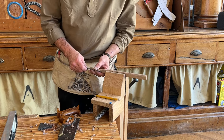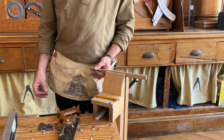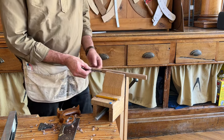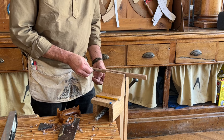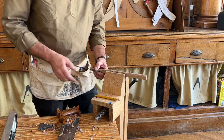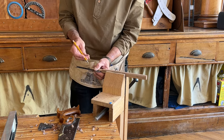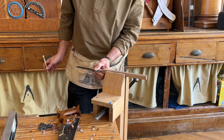This is the full length tenon and it is about two and seven eighths inches long — that's too long. We want two and a quarter inches. So I'm going to set my ruler on the tenon, and as soon as it starts to go up that swelling and up that ramp, I'll pull it back just so it's flat where it needs to be. Then I mark the length of the tenon I want: two and a quarter inches.